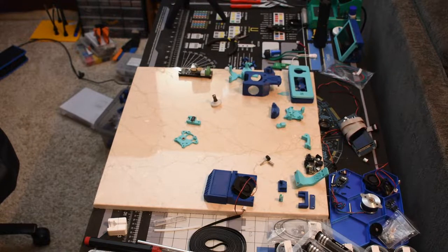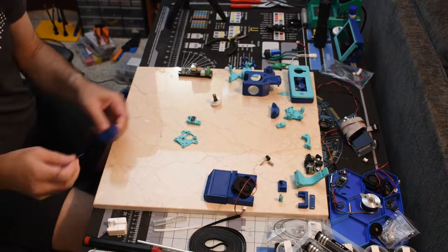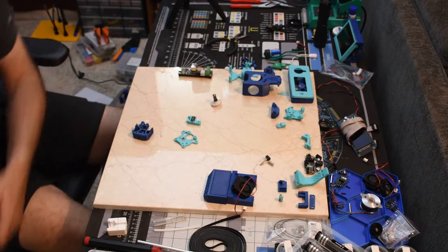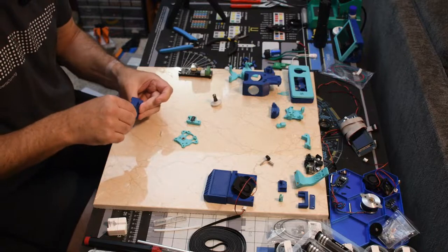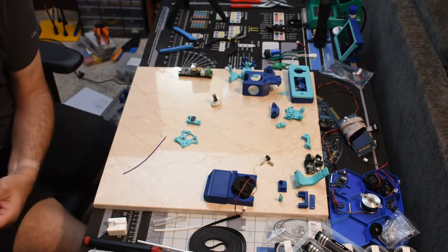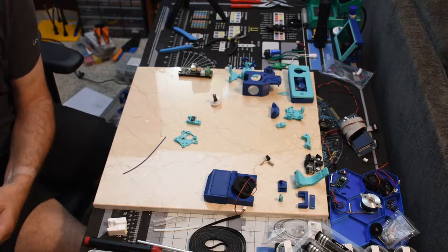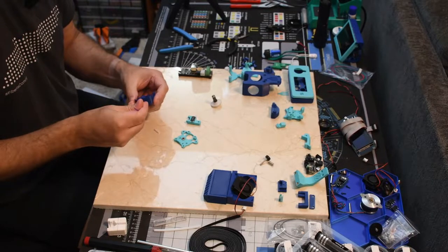Let's get a piece of filament that we can test and make sure that path is clean. I thought I had one over there from where I was putting the Stealth Burner together, but I must have gotten rid of it. So just a piece of filament, and that goes in there. Looks like we're still a little tight at the bottom. Now it goes through nice.